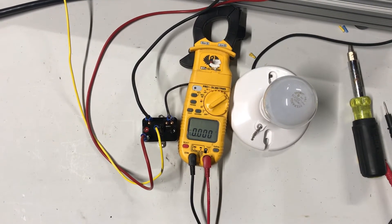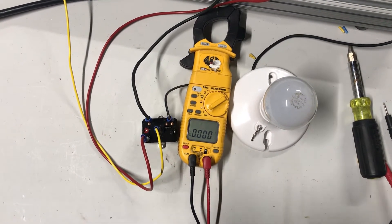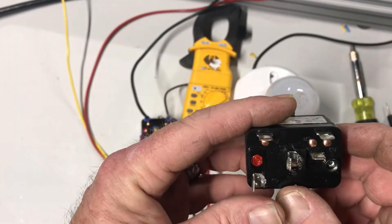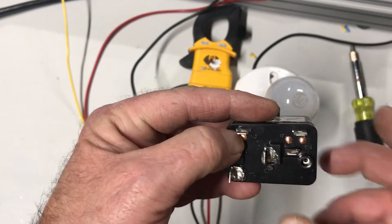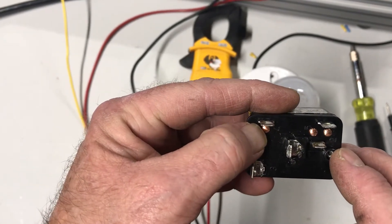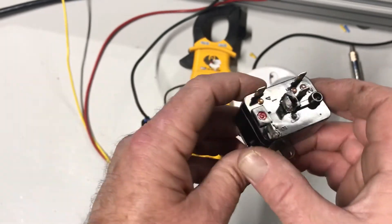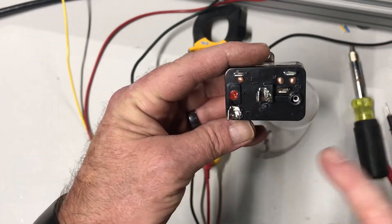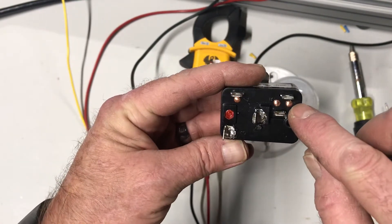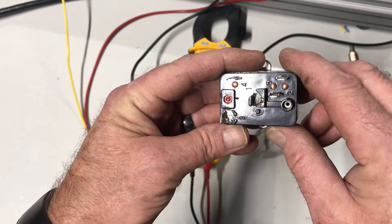In this video we're going to show you how to tell if a relay goes bad. I have a relay here — it's a 24 volt coil. It has power coming in and a set of normally open and a set of normally closed contacts. The way to tell which is the coil on these is that the coil is the soldered terminals. The contacts are the riveted ones.